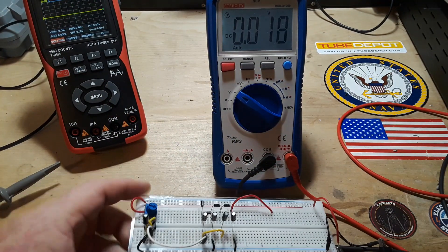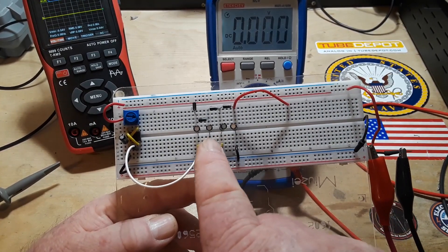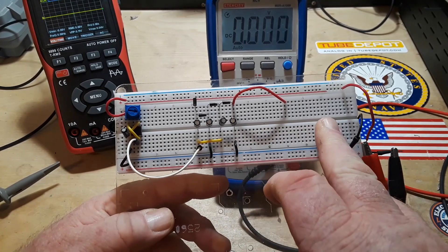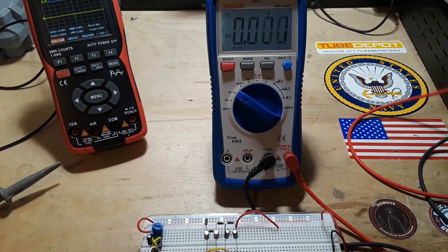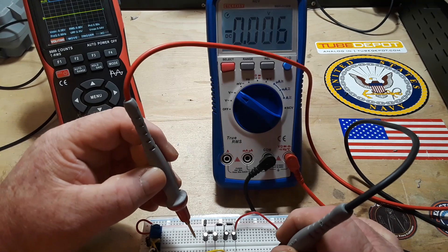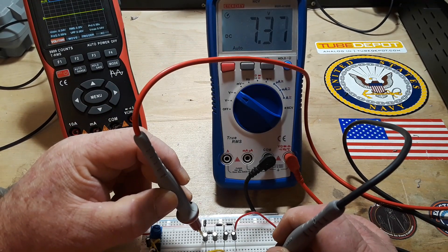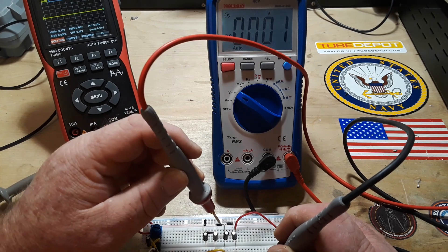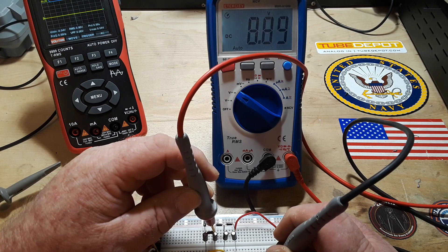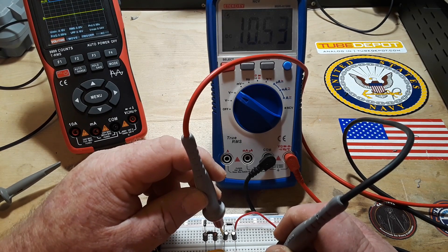I hope that makes sense, because it's a really useful circuit. This is only two stages — everything's done in pairs. You could fill this whole thing up. So what are we gaining per stage? First stage we're at 7.3 volts, second stage is nine volts — so about two volts per stage is what we're gaining.